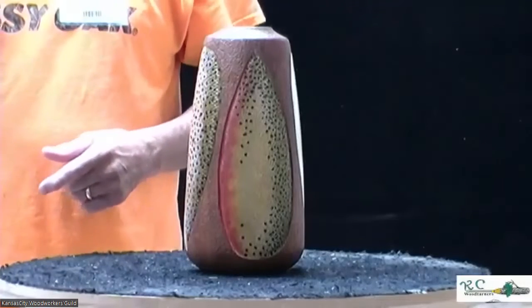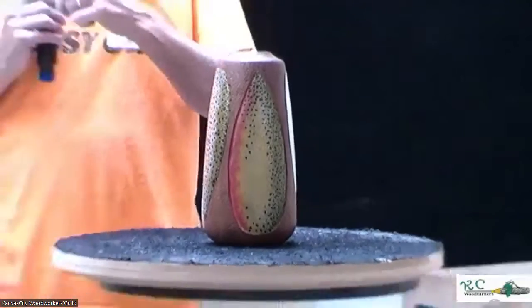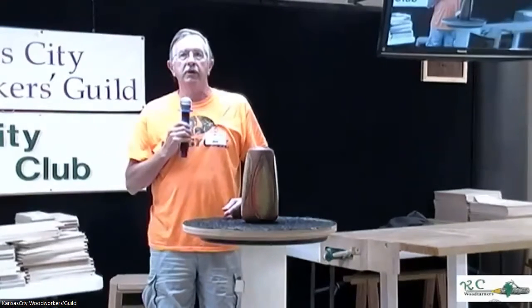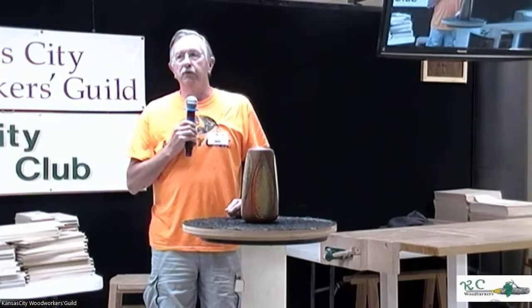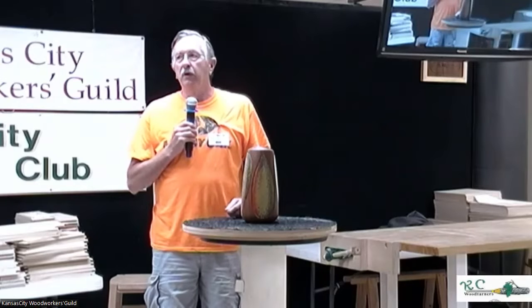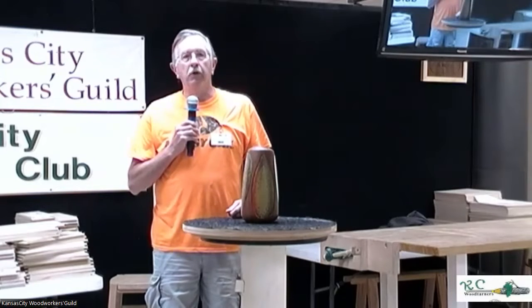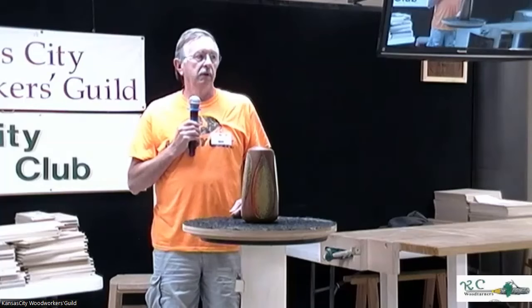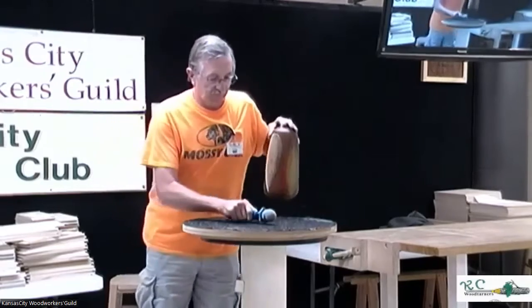The little hollow form piece — I cut down a basswood tree a year or two ago with that idea in mind. A guy named Gordon Pembridge does a similar style and it's worth looking him up. It's basically a hollow form that looks like a top hat with a shelf coming out the top, hollowed to about three-sixteenths of an inch thick, then let dry and cut out the fish forms. The inside was done with metal reactive paints to give it a blue-green look like water.